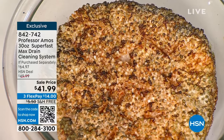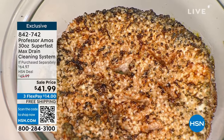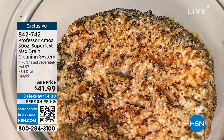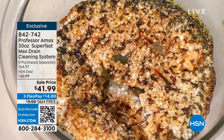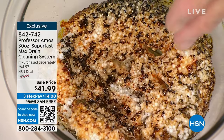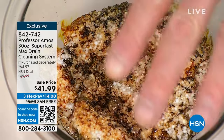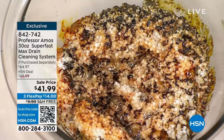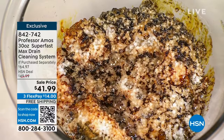There it goes — let the product do the work. Work smarter. Don't put the plunger down the drain. Don't put the snake down the drain and cause wear and tear on the inside of the drain line. Within probably another minute this is going to be completely saponified — liquefied. Then you run hot water down it. Pour it in, leave it to sit, let it do the work. For hair, it takes about 10 minutes.